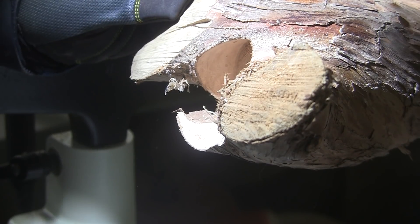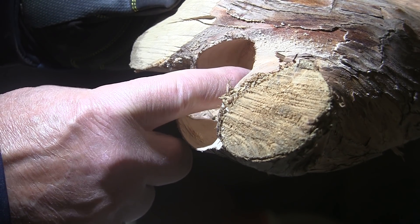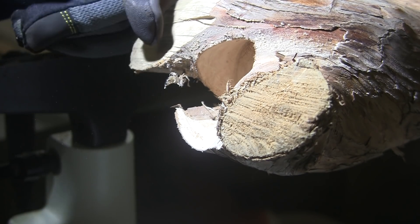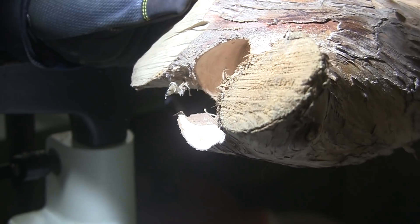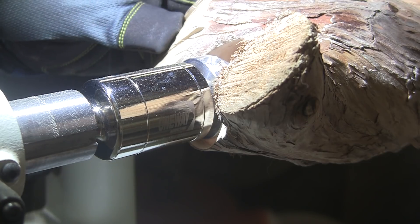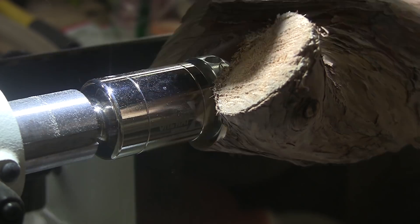What I figured out, being a novice at this, is that once I drill a hole all the way in here I won't be able to provide any tailstock support to do my turning out here. Because this is about seven and a half, eight inches long, that's a long ways out from the chuck with no tailstock support. So I'm going to bring my tailstock up now and drive that live center in there so that I have some support while I do my turning at the top. It's going to be a little close but we'll make it work.